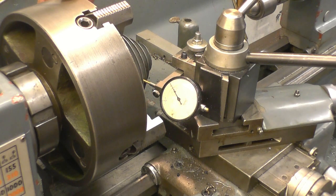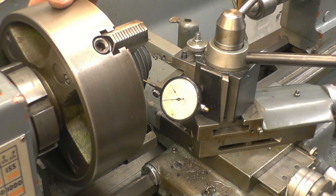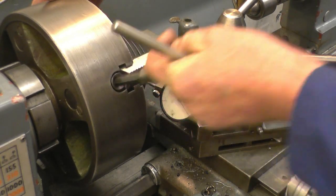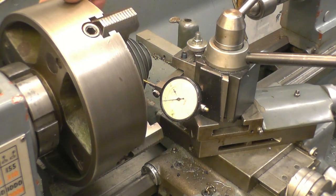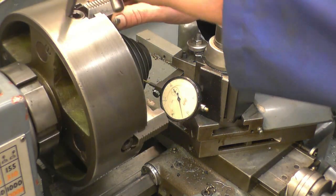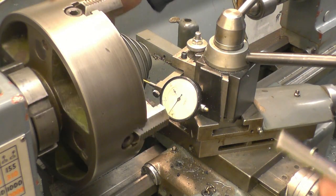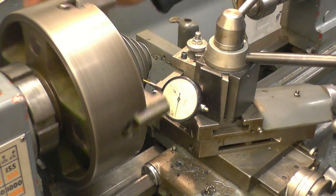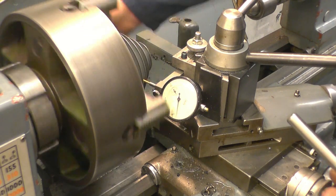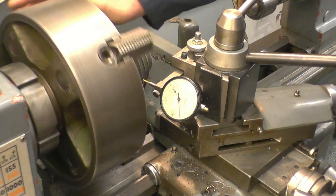You can find the high side, which is that one - it's the opposite one. Get a nip on that one, high one which is that one. Tighten the high one which is there. What I want to avoid is putting too much weight on the pulley and damaging it. It won't be perfectly round, it'll be somewhere near round on the pulley. It's within a couple of thousandths there.